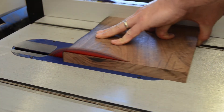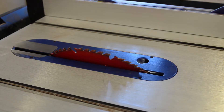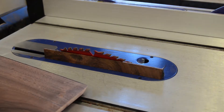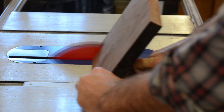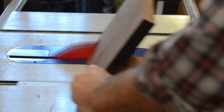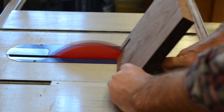After cutting the walnut in half to create two side pieces, I beveled the bottom edges so they would rest on the rails at an angle. Using a beveled scrap piece and my miter gauge on the table saw, I cut out the slots where the rails would go through the walnut. Rather than changing out blades to use the dado stack, I just made multiple passes so I could sneak up on the proper width of the slots.